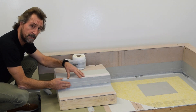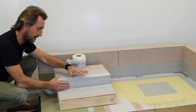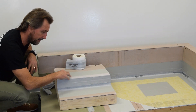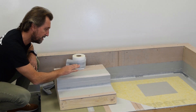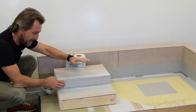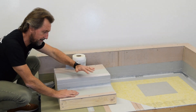This section here happens first, and then the windows or doors get placed in. We can use our butyl tape along this detail, or we can use our RF fabric. If the butyl tape goes down, the P39 gets coated over the top of it afterwards. If it's our RF fabric, we wet that fabric into the P39 membrane along the whole section, so we've got a seamless detail once it's completed.